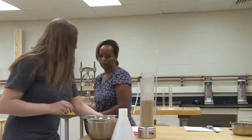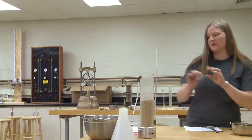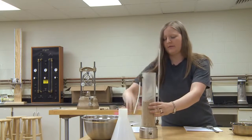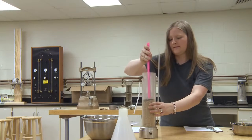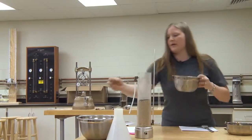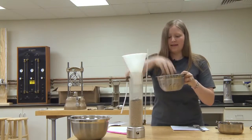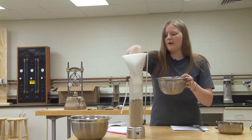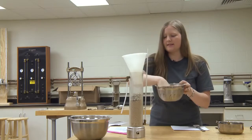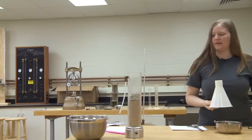The next thing that we are going to do is place a second wire mesh on top of the soil sample, again to keep any soil from escaping during uplift. From there, we are going to place some of our stone aggregate on top and this is simply to weigh down the sample. Water can flow freely through this, so as far as the sample is concerned, this is nothing but air. We are simply weighing down the soil so we won't have any uplift effects.